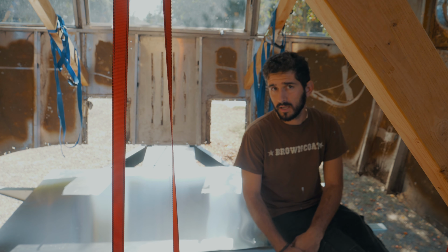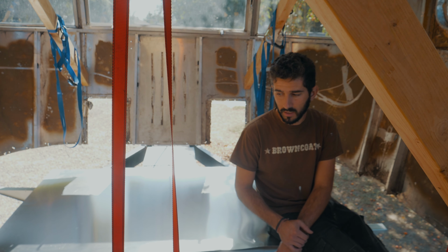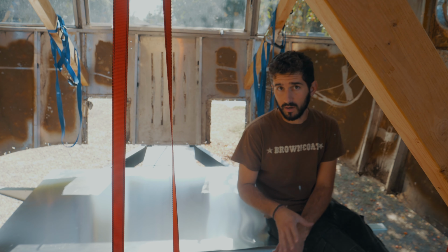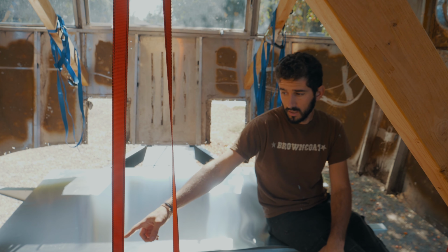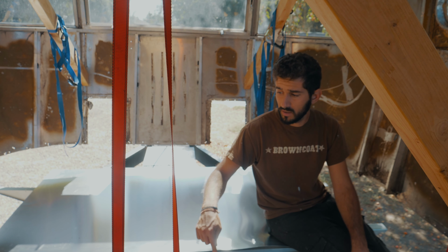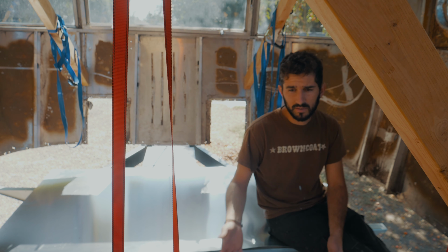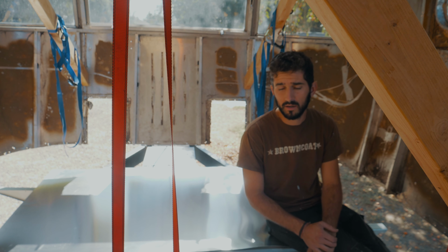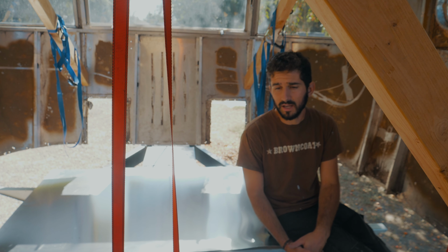So the only other thing besides insulation that goes under the subfloor inside the frame area, besides the tanks and the plumbing that goes to that, is the brake wires, which run from the tow cable to the axles. And they had it running inside here, but I'm thinking I might run it underneath the frame, just underneath where it's exposed. And that way, if anything happens to it, I don't have to take the belly pan off and dig around under the floor to try to find a short in a brake wire or anything like that. Though, nothing should happen to it if it's inside and protected.